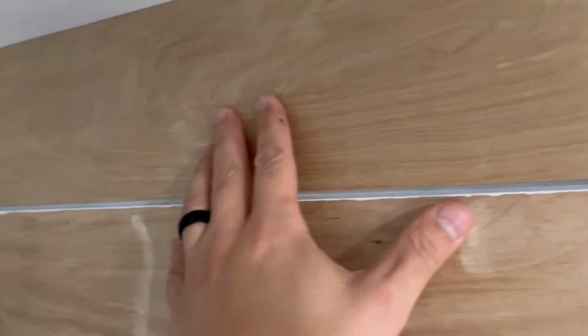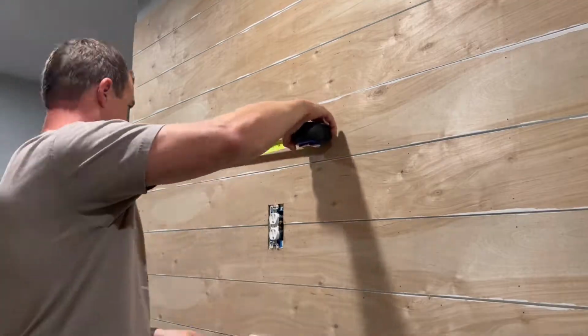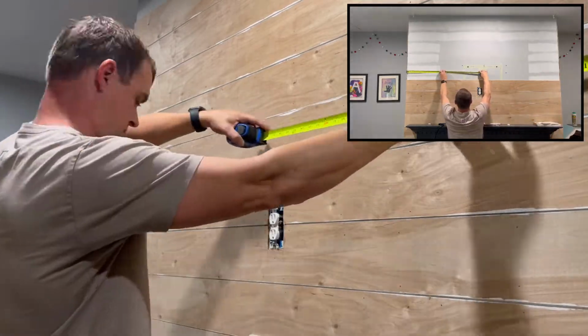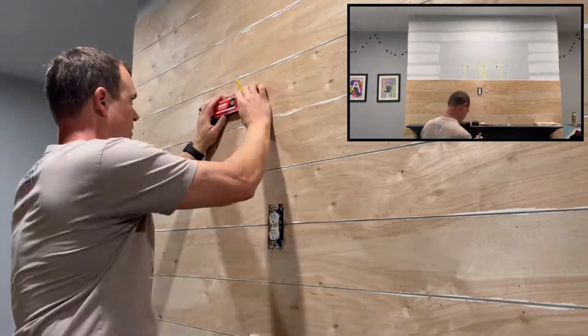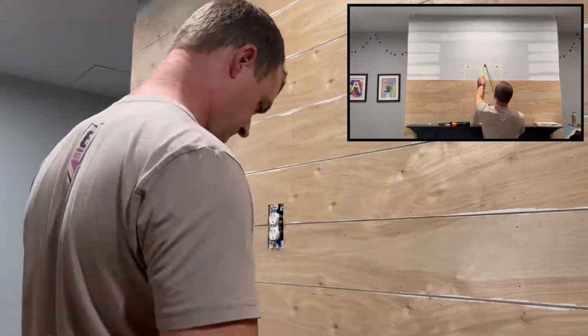And perfect, 1/8 of an inch gap. And remember that step from earlier where I marked all the holes. Now I'm going back and marking them again so I can drill these just with little bitty pilot holes, so when I put my screws back for the TV brace, it'll go right back into the stud where it was before.